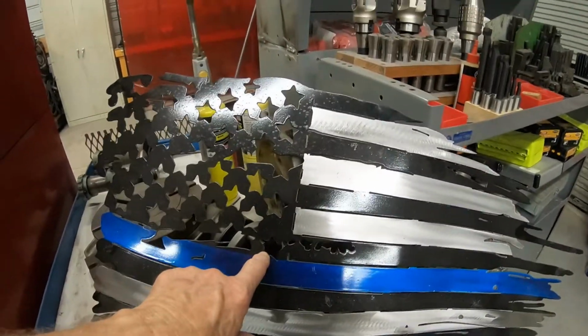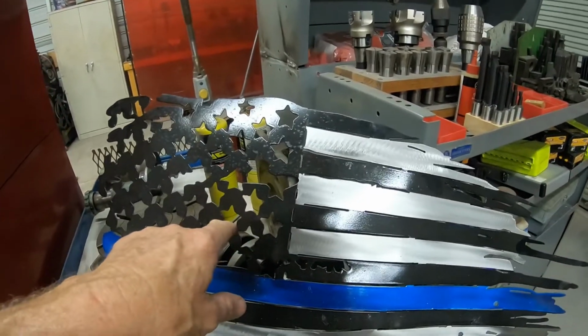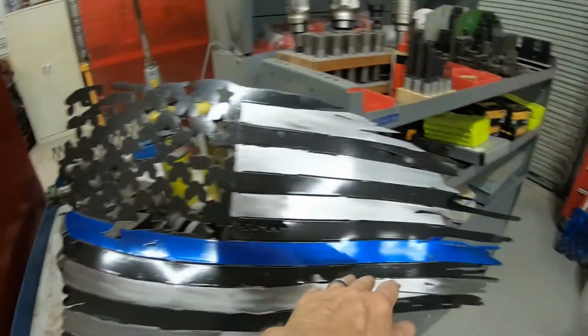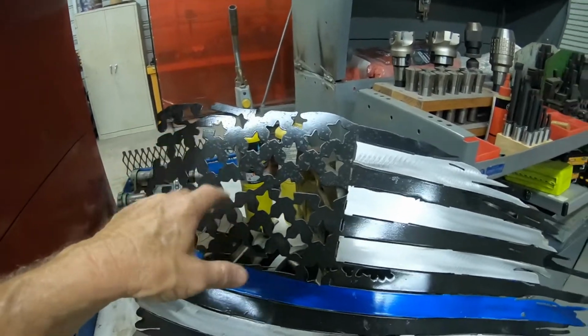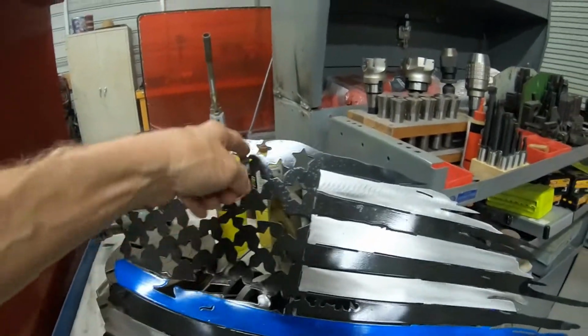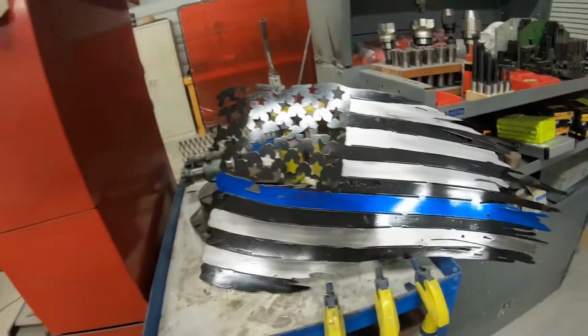and then the compressor and the plasma would kick on at the same time, because every time it would cut something out and move, it shuts off, comes over, turns back on, and plunges in and cuts. It'd be doing really good on most of these straight cuts, and then when we got in here, it was doing a lot more cutting, starting and stopping. The plasma would shut off, but the plasma table would keep running, so you'd think it was still cutting, but it's not.